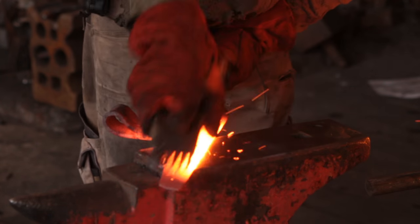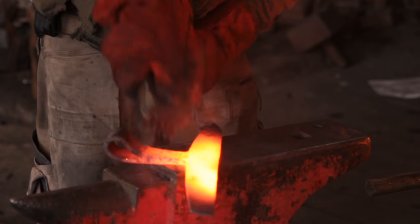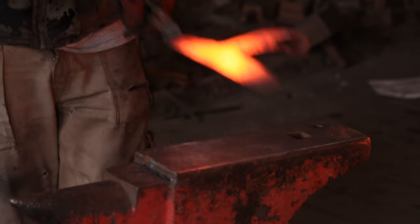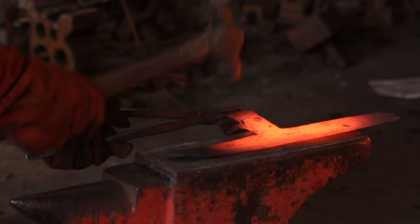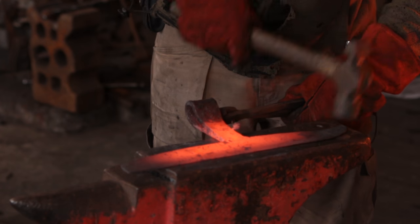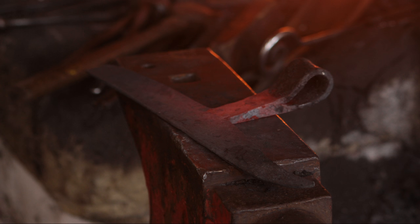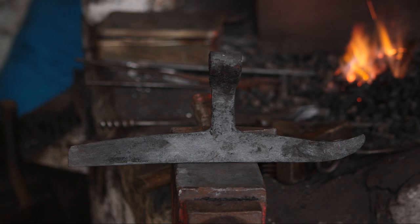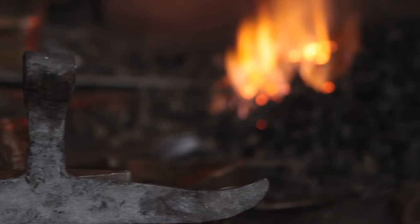With it all welded I'll give it a big scrub, get rid of all the muck from the fire. If you're using a gas forge you probably won't get it quite so dirty, but it's something to keep an eye on with solid fuel. I give it a straighten — it doesn't need to be perfect at this stage because we're still going to drift out the eye, but keeping an eye on straightness saves time later. That's the blank — it is starting to look like the old illuminations. You can see the tabs aren't quite as blended in as I'd have liked, but there is a nice transition on the neck, and I think the tabs are a good idea to take further.